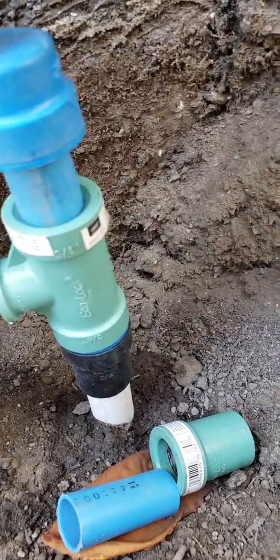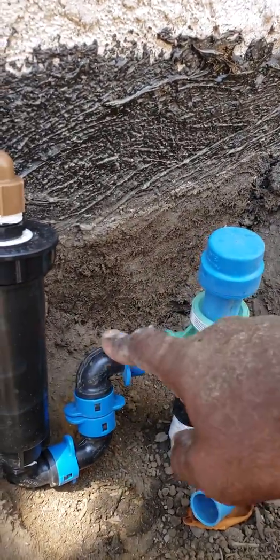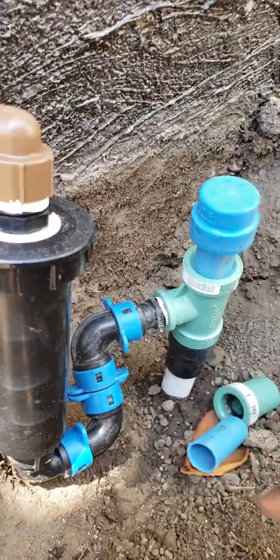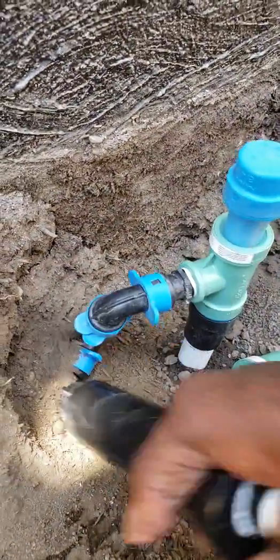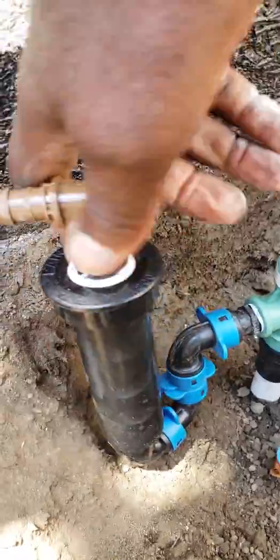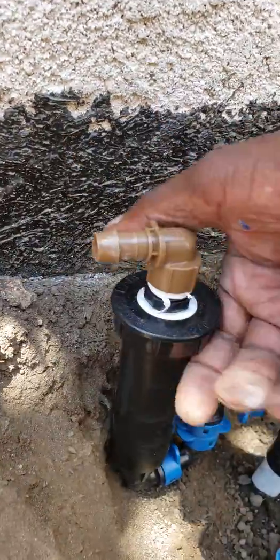One thing that's really unique about the Blue Lock is we have 360-degree capabilities — we can swing this all around. We have a fitting going straight into our T, then an elbow also on a 360 so we can adjust it up or down, and then another threaded elbow up into our conversion pop-up, which is a Rainbird pop-up. It's really nice because I can turn this toward our side emitter, or turn it up to bring it flush with the soil line, which is what I'm going to do. We can also tilt it a bit so the pipe lays laterally on the soil.